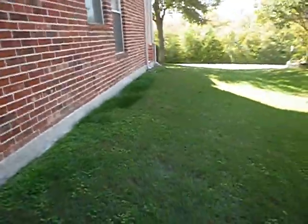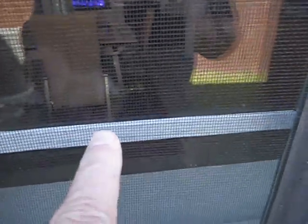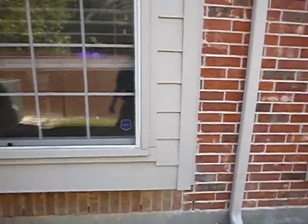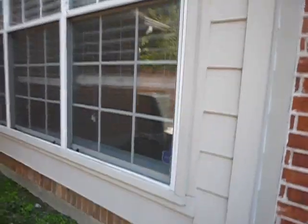This is probably the vent for the kitchen on the west wall — this is the breakfast area. There are marks on the mortar right in there. The seal is gone between the two panes of glass. When you lose your seal on these windows, you do not actually lose any efficiency — you won't be able to measure that — and you don't lose any security. It's just ugly. The seals are broken on that one — see that right in there.